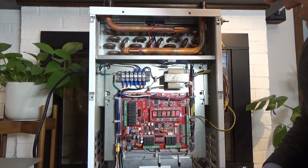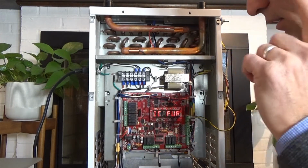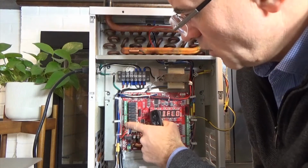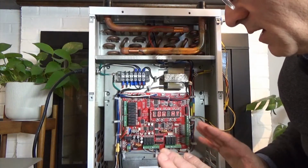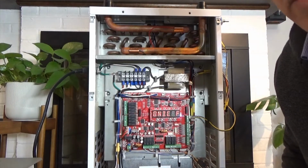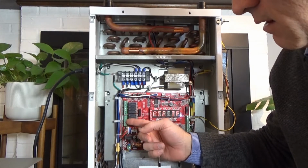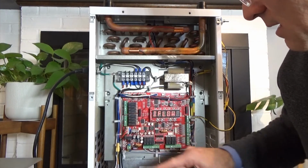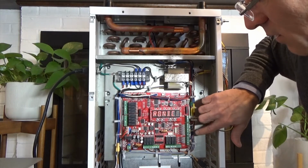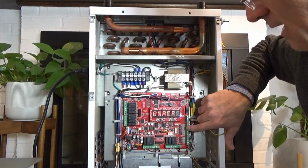Again, I mentioned the wiring. So again, recall that our AC output is right here. On all the iFLOW models, the wiring for the AC compressor is always a separate output, and it's located right here: Y1, C, and Y2. So on your thermostat connection, do not wire your compressor from Y1 or Y2 here.